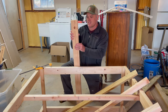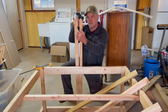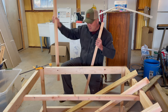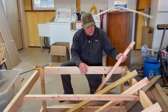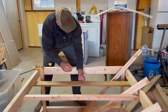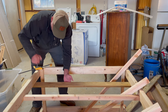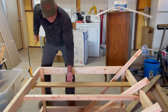Okay, so this is one two-by-four that I split down the middle — actually not exactly in the middle. This bottom half is wider in this direction than this one is. This is what they're going to be roosting on, this half right here. I'm going to attach this top half right here; this bottom half will get put on later. I like to put this on as flush as possible. So what I do is I attach this board — I've already got it marked right here on both sides where it's going to go — so I can put it flush with this bottom. I attach this board here and then I attach it down here.